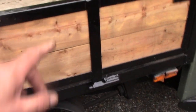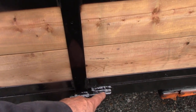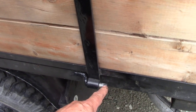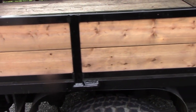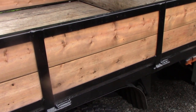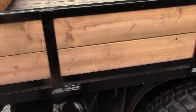On this side I made the fittings myself from flat bar and hexagonal tube, bored out to three-eighths and pad welded to put a pin in - didn't have any money at the time. On the other side I bought proper galvanised fittings which were better. However, it would have been better to cut one of the corner legs down a little bit shorter than the others - that makes it so much easier to get the sides on and off.